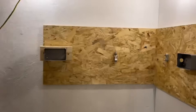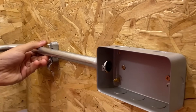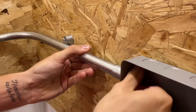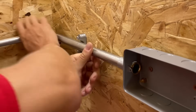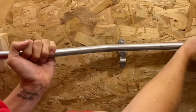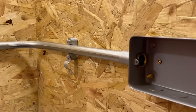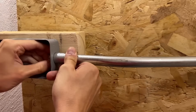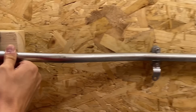Let's take it over — moment of truth. I'm going to loosely put this in the machine first, which gives you something to lever off with two fixed points. Loosely put the bush in this end. At this stage I'd rather be a little long than a little short. There we go — beautiful! You just push that back into those two saddles, it pushes loosely in there, and you're in. If we were a fraction long, it would just be a case of taking couplers off, adding a thread, tightening up, and reintroducing it.